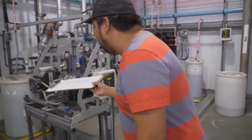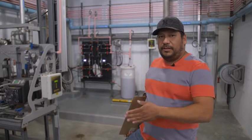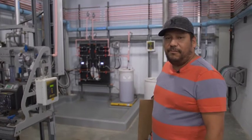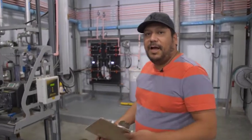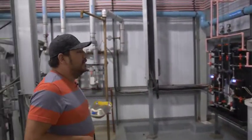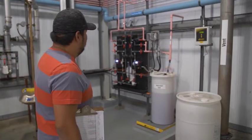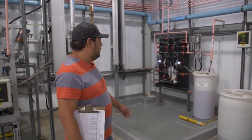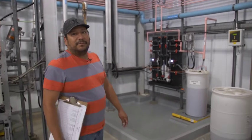This one here is labeled polymer tank — it's sort of a coagulant aid. It helps build up the floc. We don't inject it at the same point as the ClearPac 180; we inject it just a little bit further down in the clarifier. It makes the floc stronger, helps it settle out, and creates that sludge bed inside the clarifier. This one is our anti-scalant — it's pumped into the water as it goes into the RO trains, basically to prevent any scaling forming on the membrane fibers.